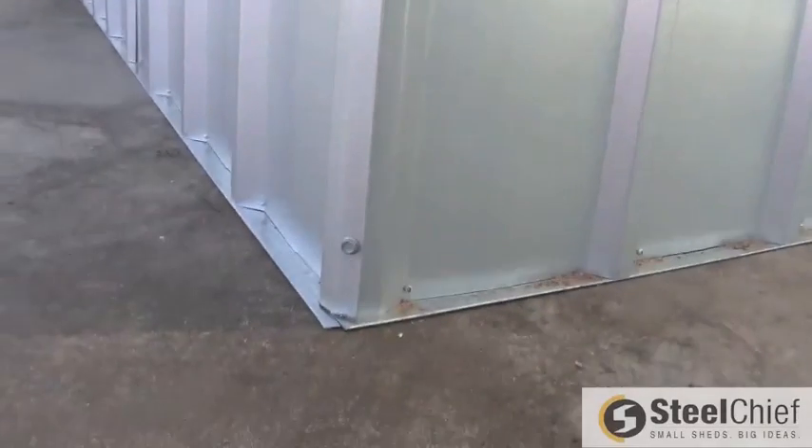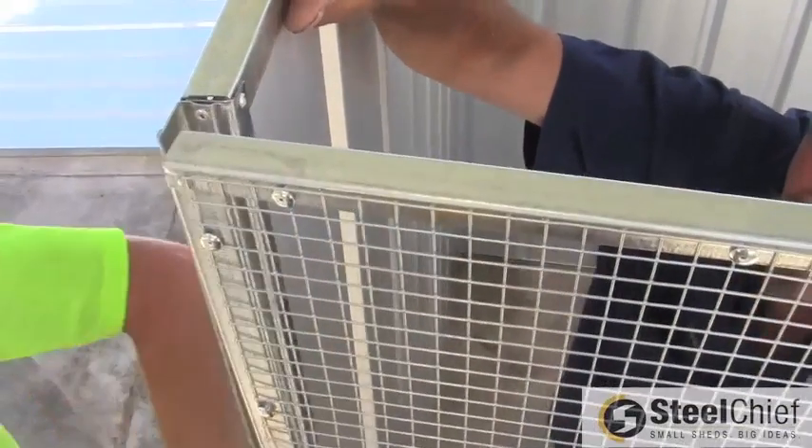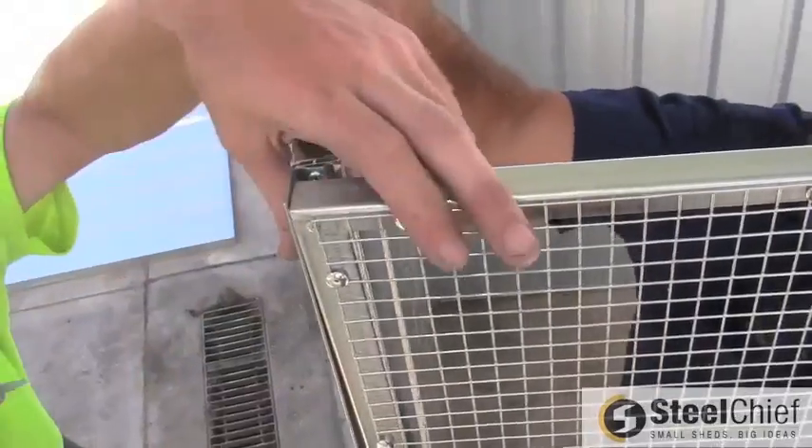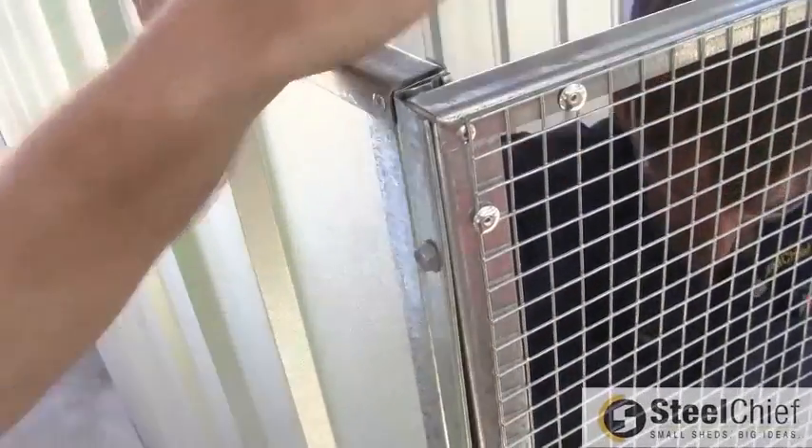Be careful not to drive too hard, as the screw may strip the hole. Next, firmly fit the front panel into the L-shaped end of the side panel, and drill five evenly spaced screws through the side into the front.